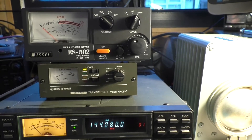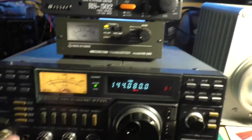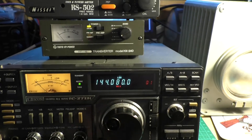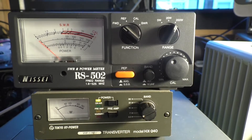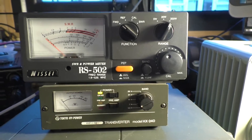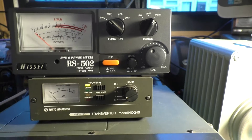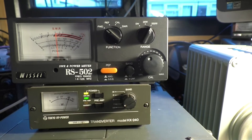We'll just try it on 7 MHz. We've gone to 7 MHz so we'll need to drop this to lower sideband. So we're on lower sideband — let's just do a quick transmission. It's showing 50 watts on the top scale and a little bit over on the bottom scale. So I can probably knock the power back a little bit. Let's just do it again and tweak it back a bit. That's better — about 40 watts as it should be.